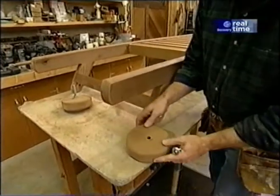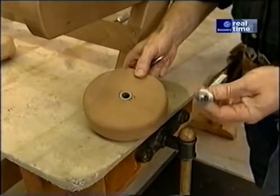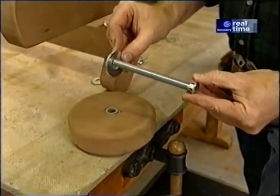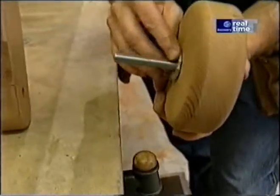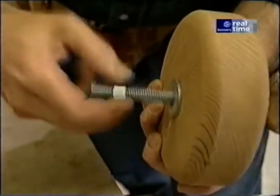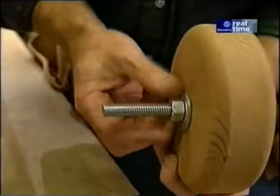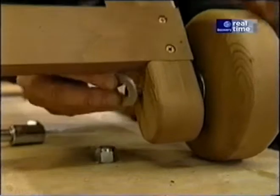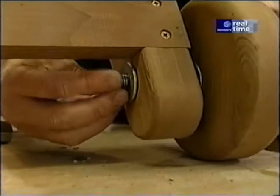After the epoxy set up I ground off the excess with my sander. The axle is going to be this half-inch carriage bolt. I'm going to have a five-eighths-inch washer which slips over that first, through the wheel. On the other side, a half-inch washer and a half-inch nut, which I'll bring on far enough to let the wheel spin freely. There's a spacer to keep it away from the leg. I slide that assembly through the hole we pre-drilled in the leg, then another half-inch washer, and a half-inch locking nut which has a nylon ring to keep it from backing off.